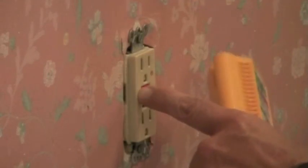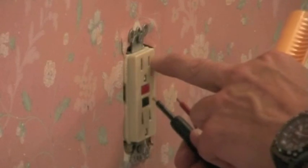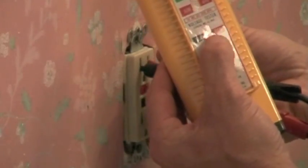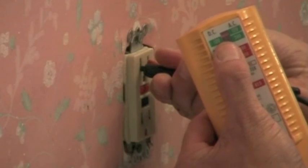Never take this out unless you know the power's off. I'll take this tester and put it in here. Once I put these two prongs into this slot right here — you don't need to worry about the bottom slot, that's the ground — you put them in there and it's going to light up. That tells me I have power — 120 volts coming from there.